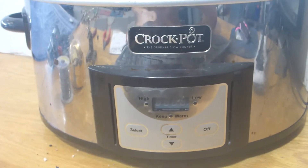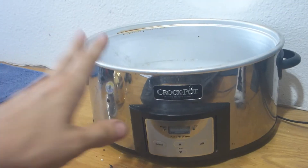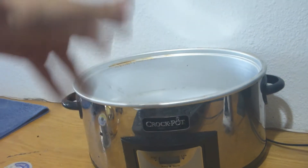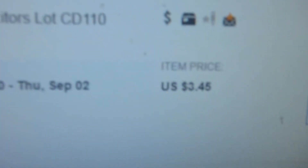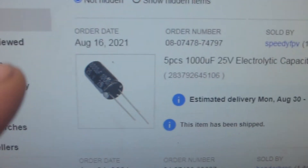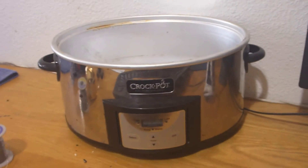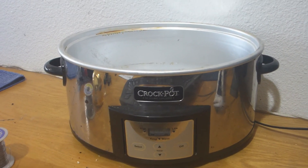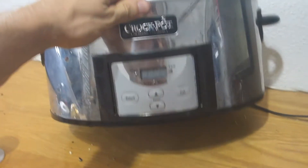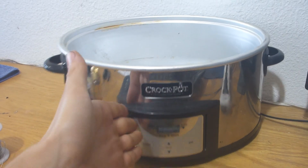The thing works. It was only $75, but this throwaway culture attitude and mentality really upsets me. We've got this crockpot and all of the cookware and that lid and that glass and all of the accessories — all of this would have been thrown away if it wasn't for a $3.45 shipped pack of capacitors, five of them. So I can fix five of these crockpots for under $4. Please, if you have a digital display on your crockpot and you plug it in one day and it does absolutely nothing, by all means do this repair. Please save yourself some money. That was super quick and easy.